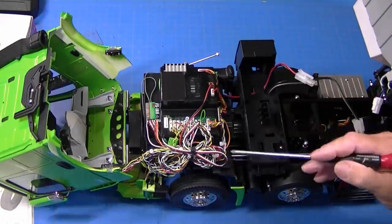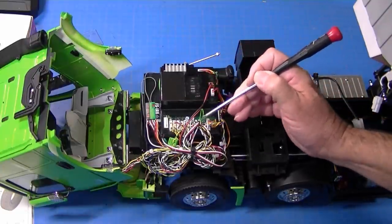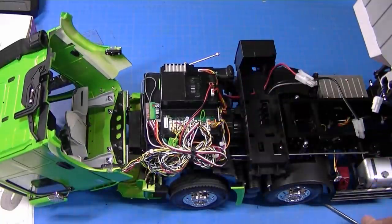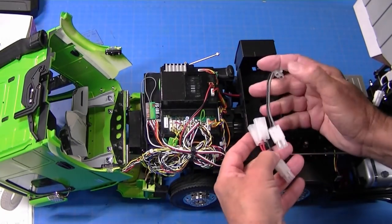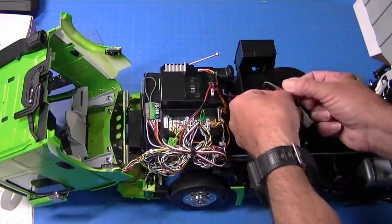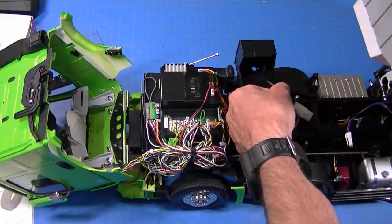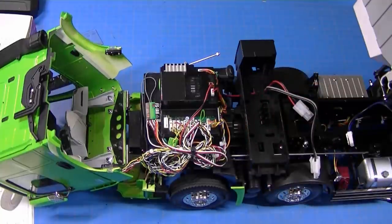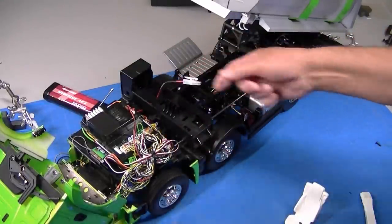There's my MFC-03 all plugged in. I brought the wire up for the tipper bed and plugged it into the second position right there, so now we're ready to go. Tamiya makes this little jumper where you can jumper the two connections together and then hook it to a battery, but I don't like to do that. So I'm going to clip this and actually solder these into one connection — just makes it a little cleaner installation for the way I do things. I did solder those together, which is a lot cleaner installation.